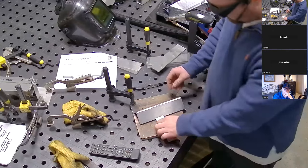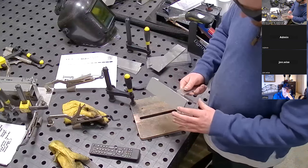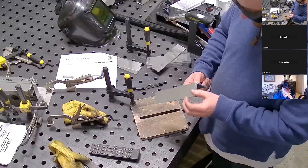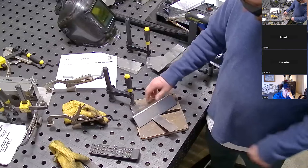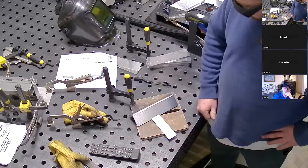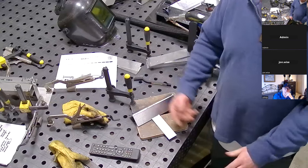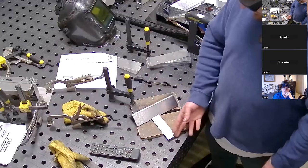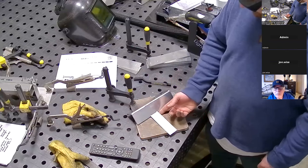The reason I ask about the heat is: since aluminum holds heat like it does when you MIG weld, that part would be super hot and you wouldn't want to go back and put any more weld to it, or you're just not efficient because the part's too hot. I was going to ask you to change the wobble speed and widen the weld out — go over that path and see if, by widening it, it would fill that trough.